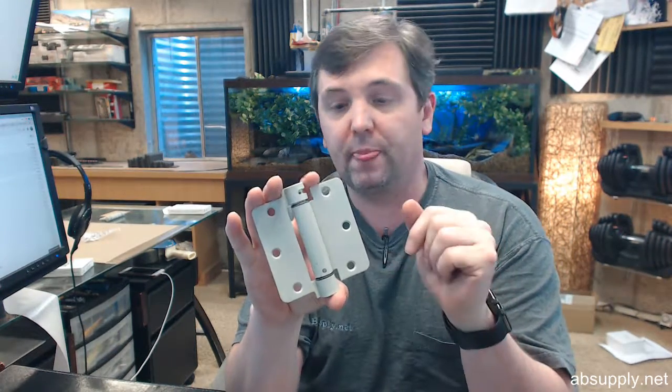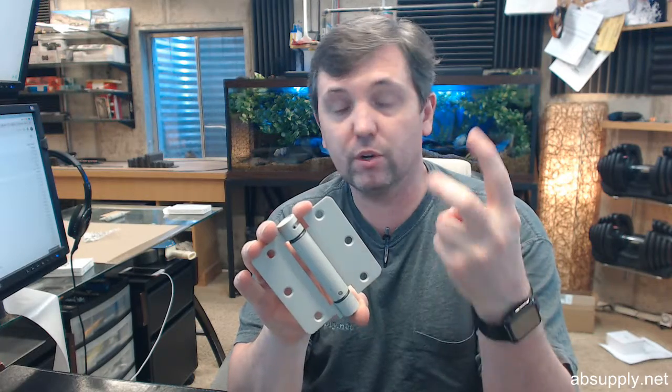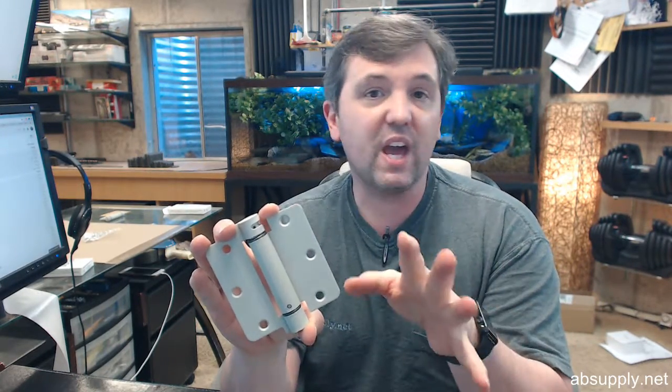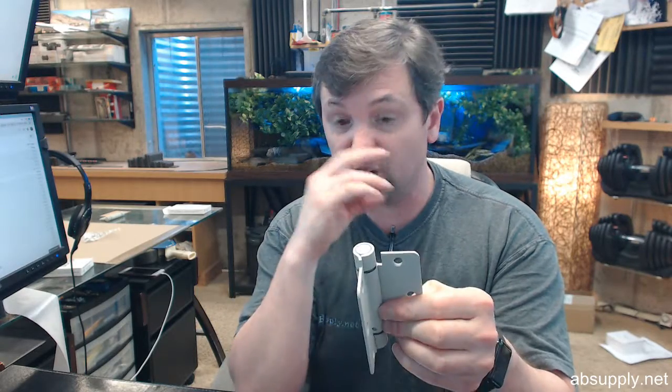Now, let's get to where you're going to use this. There is a link below this video to a document called Certifications and Hinge Selection Guide. That table on the lower part of that link shows you how many spring hinges you need based on the weight of the door. If you've got a door that's 70 pounds, you're going to go with 2 spring hinges and 1 standard hinge. Or if it's heavier than that, go with all 3 spring hinges, provided that you're really not exceeding 90 pounds. Now, I'm a fan of all spring hinges, and here's why.